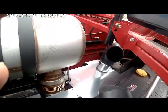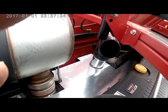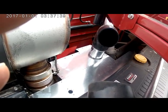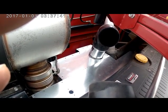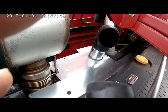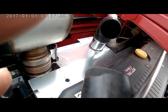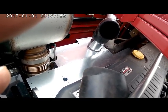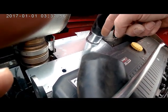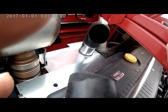You can actually see I have the piece representing the top of our enclosure set in place there, with a stub riser setting in it — I haven't hooked it on because this is temporary. So we come up out of that and go directly into another rubber 90. That rubber 90 is aimed directly at the end of this one, and there will be a 15-inch piece of aluminum tube that will join those tubes. So we're going to make a 90 over the head, make a vertical 90, and go into that stub connector right down into our enclosure.